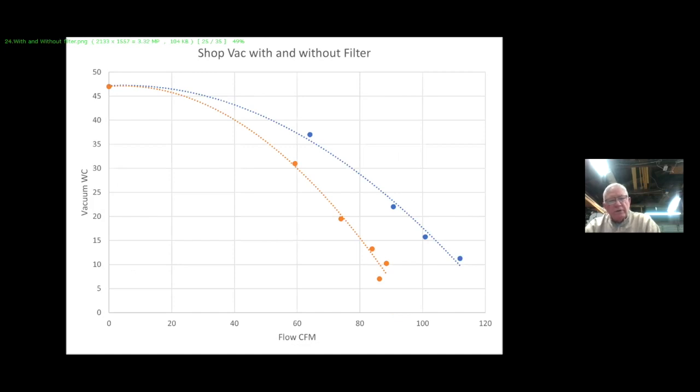Any other questions? Yeah. Can you hear me? Yep. Okay, so if you have a vacuum pump, those are designed to run against a vacuum. Right. It's just meant to run that way. Whereas if you have a shop vac and you plug the end of the hose, you can hear it working really hard. No, that's backwards, Peter. The reason you hear the change in tone for the shop vac when you plug it up is because the load's gone. It's essentially the motor is freewheeling at that point in time. That's why the pitch comes up. Okay. That I didn't realize, but the comment I was actually going to make that goes along with that is that a lot of times they use that airflow to cool the motor, and if you have a really tight system, there's no airflow, so it's kind of running.